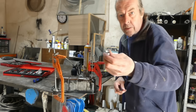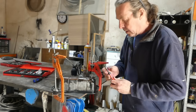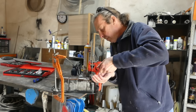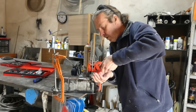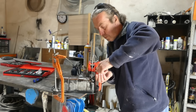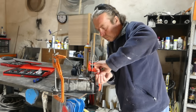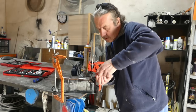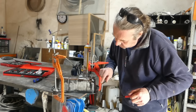We take our insert — it's got a little tang on it. That fits on this little tool here, and then we simply screw the thread into the hole we've just cut. This will be our new and permanent thread. When you're going in, never come back out because that will tighten the threads up and then break the tang off, so you'd have to start again. You want to take your thread just below the surface — like that, wonderful.